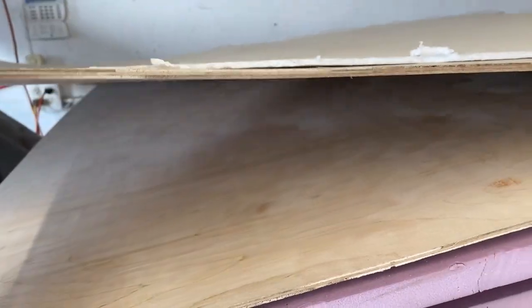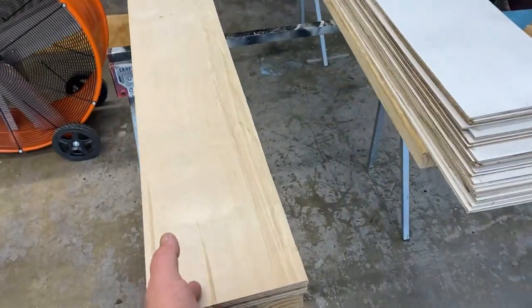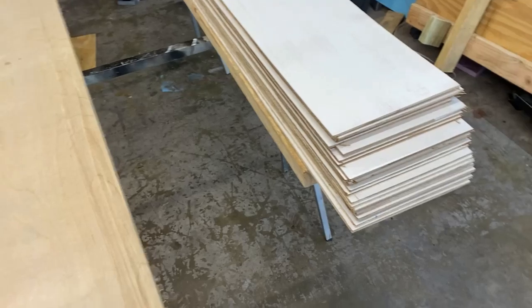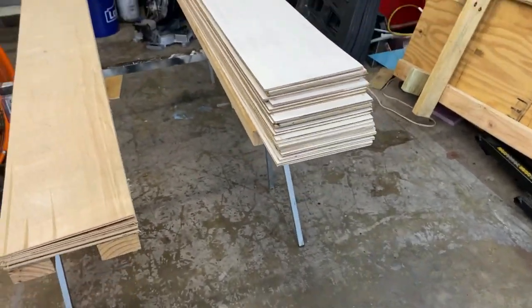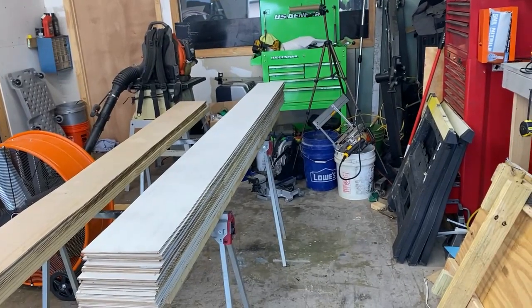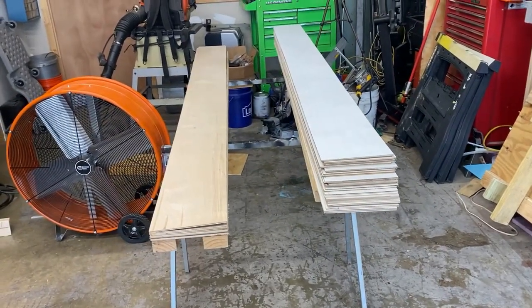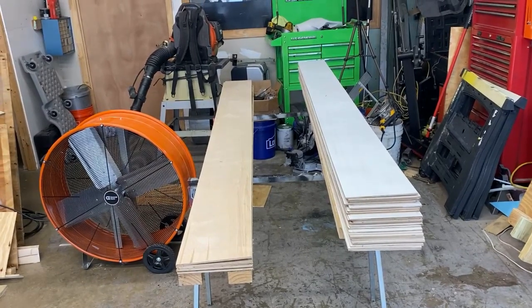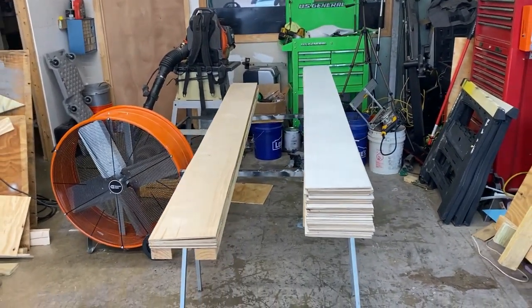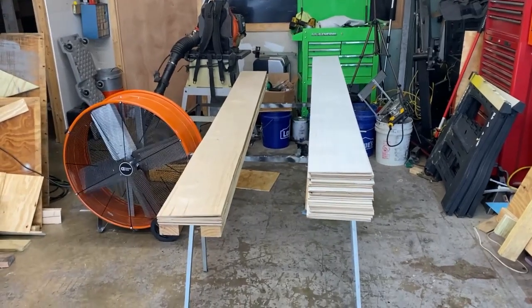Finally got a lot of that cut — here are the pieces. Some of them have been painted and stained, some are just bare wood. These are cut at eight inches — that's four four-by-eight sheets cut into eight-inch-wide pieces, and that's the shiplap going on the wall. The next thing is to install that, but we also have to put polyurethane on the ceiling on that aqua-colored shiplap to seal it up.